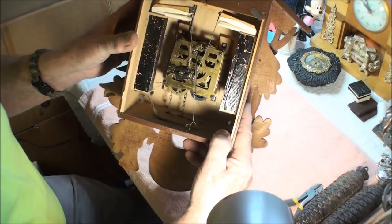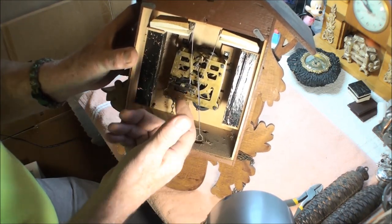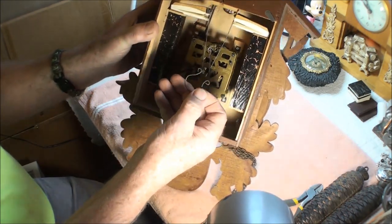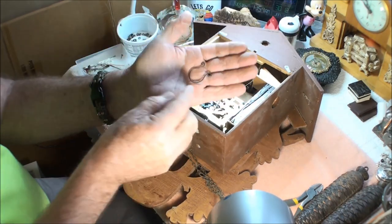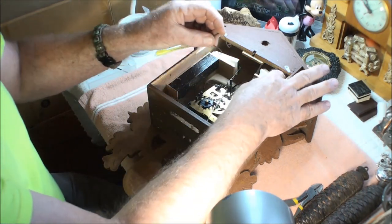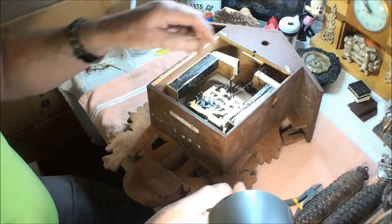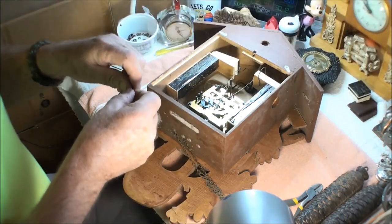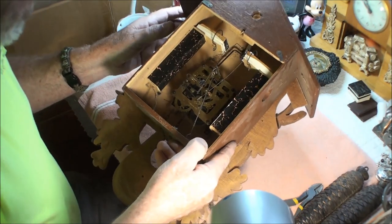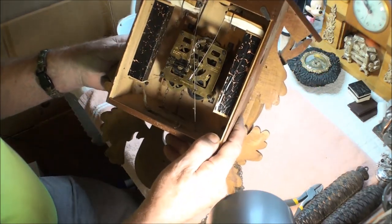The works didn't look that bad — they actually look pretty clean. It's possible they just stopped using the clock. These little wire ties are a good way to hold your bellows closed when you store it. Some people don't even care about that part, but closing your bellows will save them from getting stuck open and not wanting to close all the way. I think I'm going to go ahead and take this thing apart mainly so I can get it cleaned out.